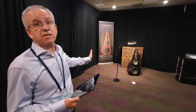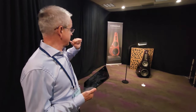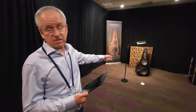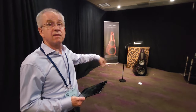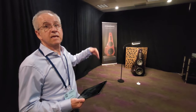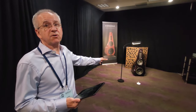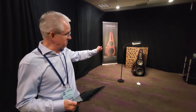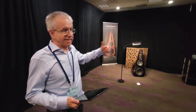It's a four-channel, 400 watt per channel amplifier, and those amps power these speakers — Tidal speakers. They're four-way active; each driver has its own amplifier. It's an active system, but the amplifiers are all external, so if you have any problems it's very easy to address.